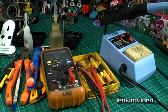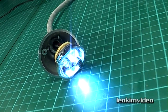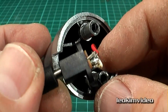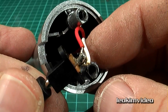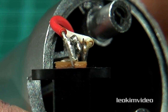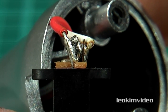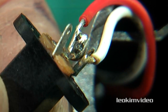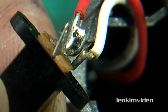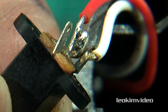It's also worth noting that to fix these little $15 lights I need a couple hundred dollars worth of tools. Now you're probably wondering about the other light which was fairly dim — let's have a close look at that one. As I said earlier, you can tell a lot about how something is made and the quality of a workshop by looking at the solder joints. Let's have a look at the join where the power comes in. There's the power jack for this light, and there's the plug, and there's the solder join — now that is a really good example of very poor workmanship. The big loophole here is that this is a low voltage unit, but there's no way I want to be buying electrical goods which have this extremely low quality of workmanship. This is a $15 light bought at Kmart in Australia.